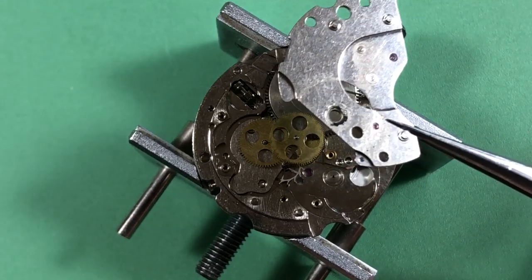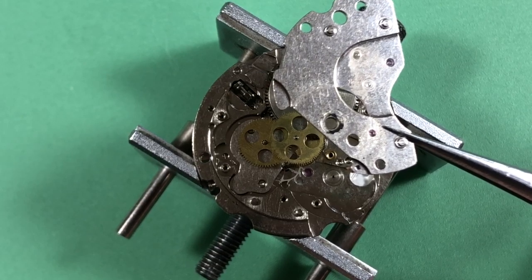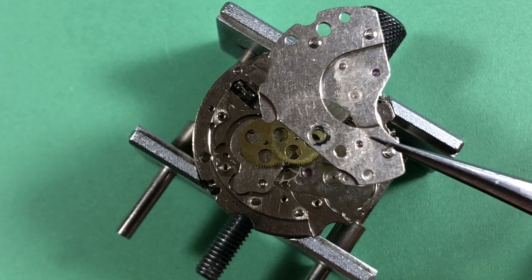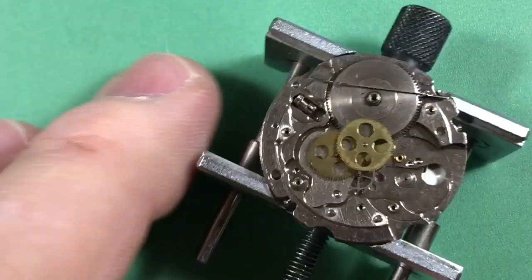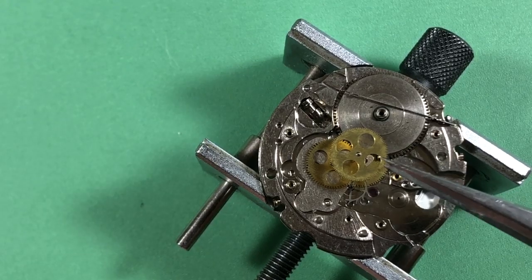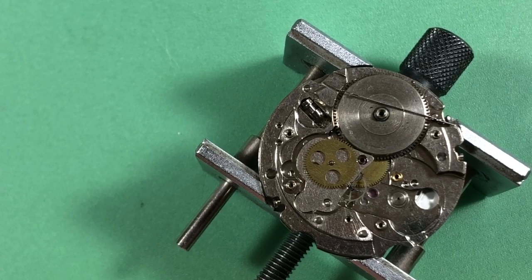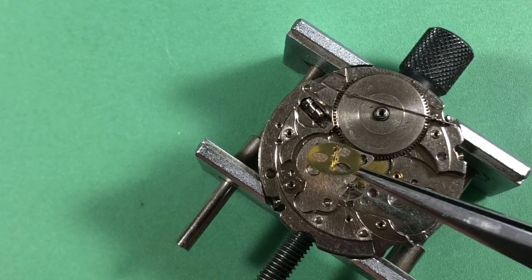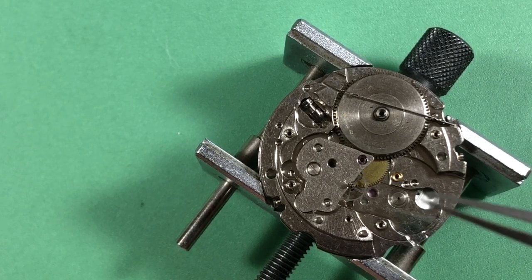There's the S2 grease — and you can see that the bushing is partially blown through. We'll have to clean that up and see what we've got. Definitely got lubrication that moved everywhere. See that hazing on the fourth wheel, that sort of hazing around the edge? That's old lubricant that got on everything.